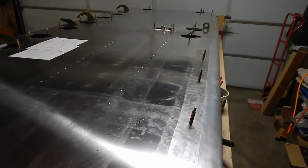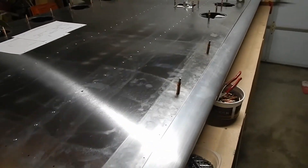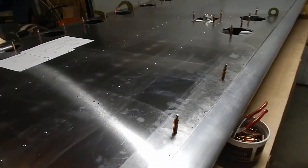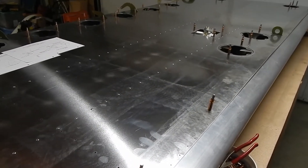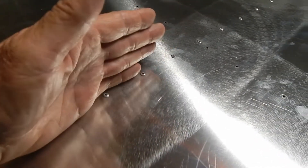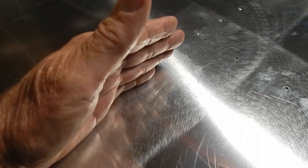I'm just about finished skinning my second wing and there's been an issue — it also happened on my first wing. On the bottom skin, where it meets the forward spar, I've got about a two-millimeter gap and even pushing with my finger I can't close it. There's a RANS service alert, bulletin number 191, that addresses this problem. The stringers fit into notches on the ribs, and those notches were not cut far enough toward the forward part of the wing, so you have to go in and grind off about an eighth of an inch on each rib.